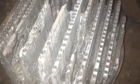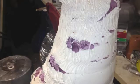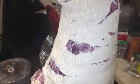We moved to a foam displacer, and here you can see the foam displacer stacked up with circular discs of foam. We've been running tests with this. At first we had a few problems with the heat and also getting the regenerative properties of the displacer working for the heating and cooling of the air.